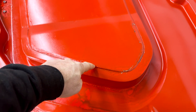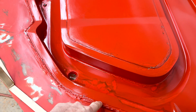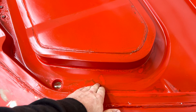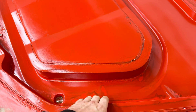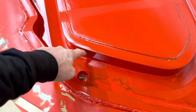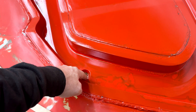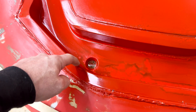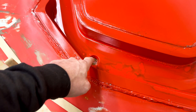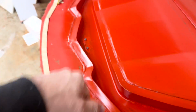Our carbon is going to come from here, down across, up to this edge — probably over to about here — but this is the trim line. This is a really not terrible angle for the carbon, it should flow pretty good. I hope we don't end up with any air pockets from bridging. But then the problem is you come down here across and immediately dip into where the hood adjusting screws go, and then back up on that quarter inch lip, then across. That's a concern, and it's mirrored on both sides.